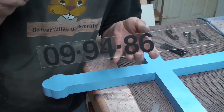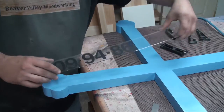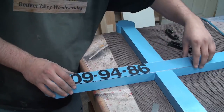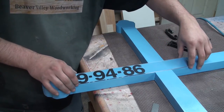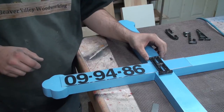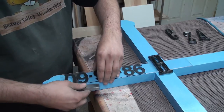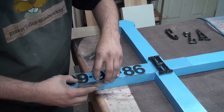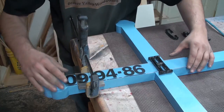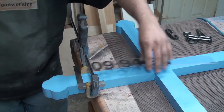On this project I had to put some stickers on there — numbers. What I did was I took a scrap piece of plexiglass about the same width as the cross, two and a quarter. By doing it this way you can actually move the numbers and find the perfect location where you're going to be placing them. I also know that the letter H is going to be right here in the middle, so I can line it up, put my machine square there right on the edge of the number zero. Perfectly lined up — now I can slide the plexiglass off.